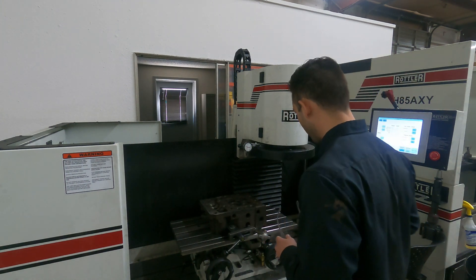With this all set up on the Rottler surfacing machine, we go ahead and hold cycle start. We let the work head move — we've got our dial indicator here. We should be at negative five, so we go ahead and touch this down. It takes a little bit of pressure and it's showing we're now 5 thou below the deck surface, so that should be good. Every time you put a head on, this comes down and you make sure you're taking the right amount off. If not, you can adjust the program or just do a skip pass at zero.